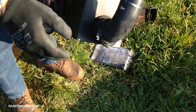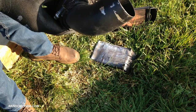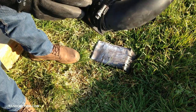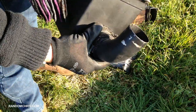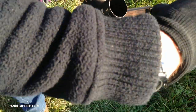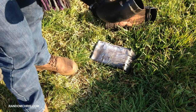The final part of the stove is this air intake slash rocket stove intake — this is where the primary air is drawn in. It was just something I found lying around in the garage. To attach it to the stove I used the same technique as the top: grinder cuts, bent it round, then placed jubilee clips and some stove rope around it for insulation. When the stove is at full working temperature, you can place sticks of wood, pellets, or whatever you like through here to add extra fuel without needing to open the door — quite a useful feature.